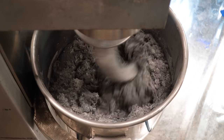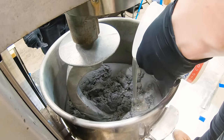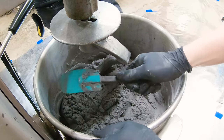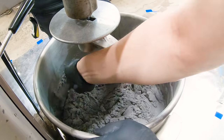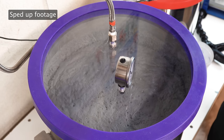The final step is to add the MDI, which is the curative. This is where time really starts to count — the second we put it in is the second it starts reacting with the HTPB and hardening the propellant bit by bit. It's also worth noting that with mixers like these, it's good to pause once or twice to get a plastic spatula and scrape the walls, since unmixed segments can remain on the side or bottom of the bowl. Once done, I scraped down the dough hook and we moved to the table to pull vacuum on the propellant to remove those bubbles.